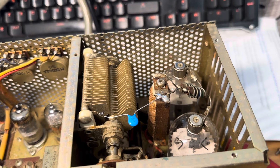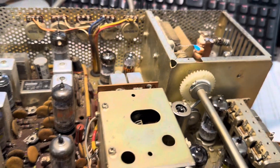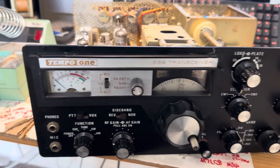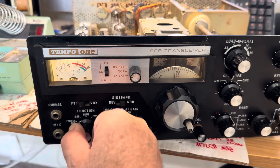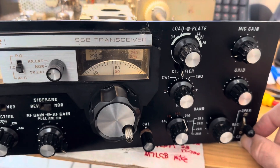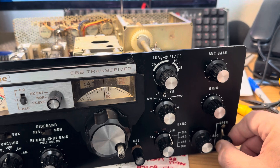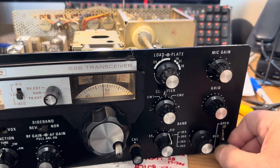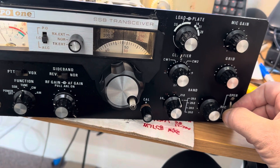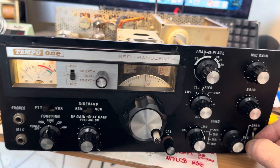In the finals compartment, just to make sure this thing is ready to go. It seems pretty good now. I also got the crystal calibrator working — I just took the switch out. The contacts on the upper part of the switch, when you push it down for calibrate, there are contacts up there that weren't really meshing. I got those working and now it has calibrate.